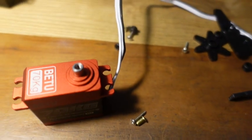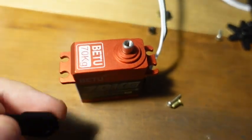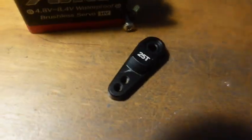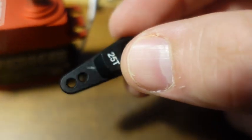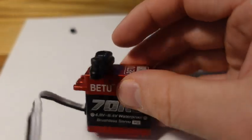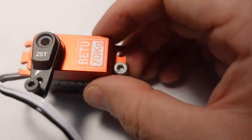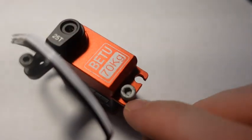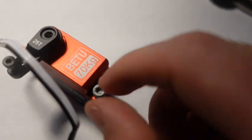In the Amazon reviews I noticed at least one person complained that all they got was plastic arms. So what I did was use a screwdriver and just etched into it — this is definitely aluminum. The thread at the end of the arm is M3 by 0.5mm pitch. An M4 screw fits nicely; M5 is too big for these mounting holes.